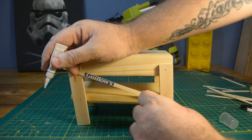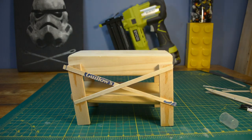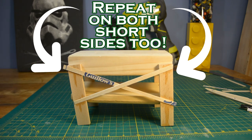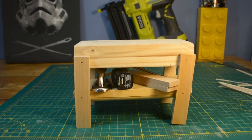That is right, the letter X can help us with this project. If we build what I'm going to call an X-bracket across the back side of the workbench, it's going to cancel out those forces that are trying to pull outwards or push inwards. If we repeat this process on both sides, that's going to make this workbench super solid. I'll leave the shelf open and accessible from the front, but that's the plan, so let's get to it.